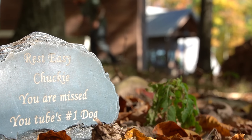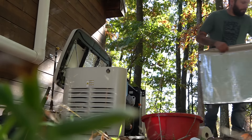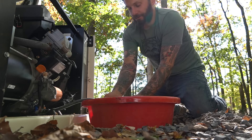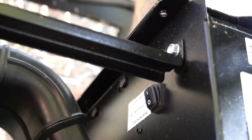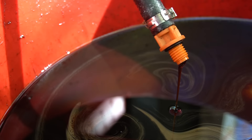We're still working on winter prep around here, and one of the things we do this time of year every year is change the oil on the generator. We typically don't use a generator very often during spring and summertime. We're on solar — we're off grid — there is no power company. Power in our house is all by the panels. That is why we have a generator. We're on auto right now, we're going to turn it off so it doesn't kick on, switch to off. I also have an auxiliary shutdown. Turn it off, open it up, take the oil out, put new oil in, and we'll start it real quick.